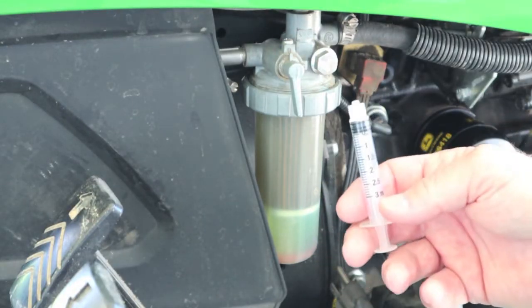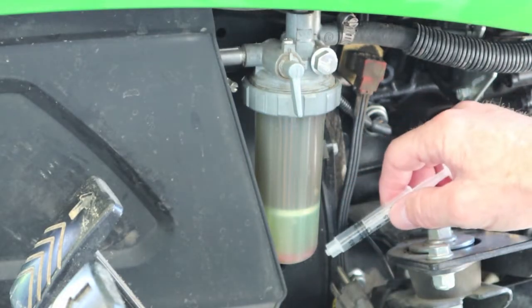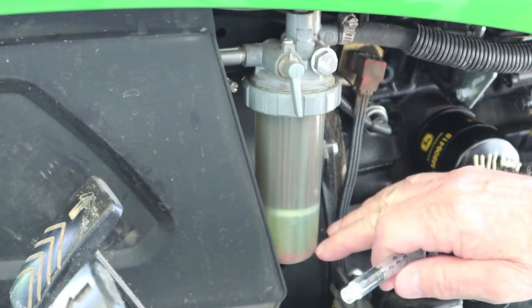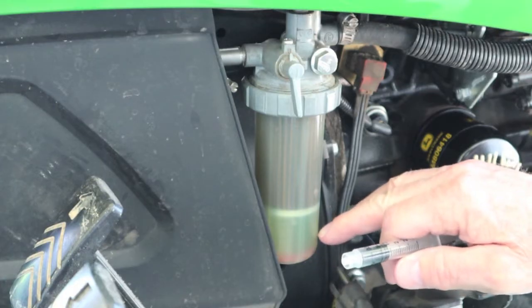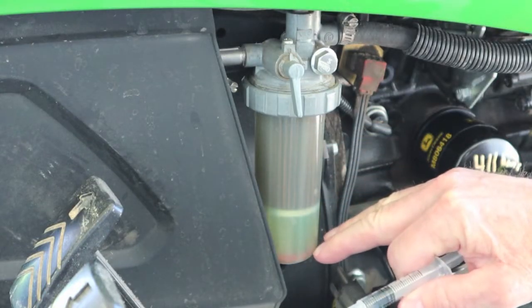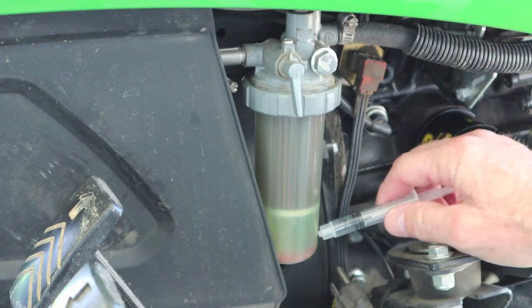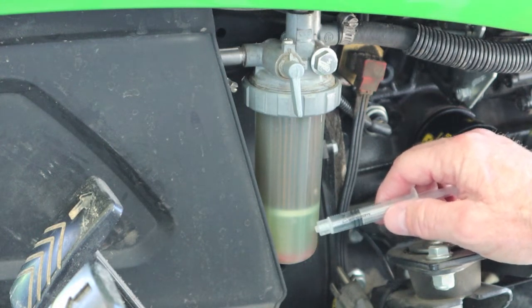One cubic centimeter is 10 millimeters on each side. I'm curious as to how much water will float the red plastic disc. John Deere puts this red plastic disc in here — they call it a WIF, which is a water-in-fuel indicator. When it's off the bottom any amount at all, it indicates water is in the fuel. Water being heavier than fuel, it'll come down here, and this plastic is made of a substance that will float in water. We'll get an idea of how much water will go in before the indicator starts to float. It should be interesting.